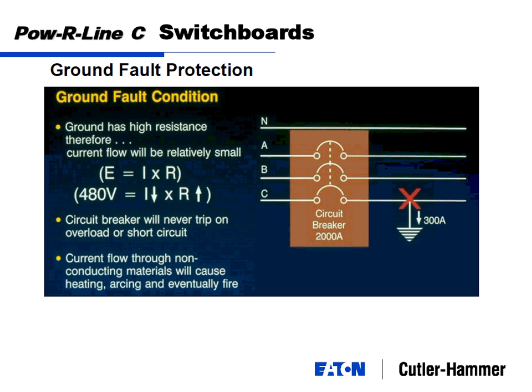Therefore, here's an example where you've got a 2,000 amp circuit breaker. If you get a ground fault off one of the phases, and there's a lot of resistance in there because this is circling all the way through and finding its path back upstream somewhere, you may get a ground fault somewhere on the magnitude of 300 amps. So if you've got a 2,000 amp breaker and a fault condition, but it's only 300 amps, are you ever going to get that circuit breaker to trip under its normal trip unit? No. That's why ground fault protection is looked at differently than any of your other tripping characteristics on a circuit breaker.